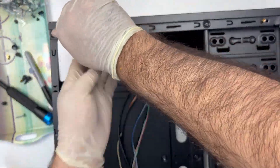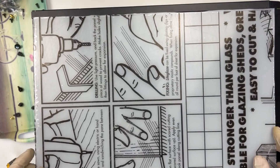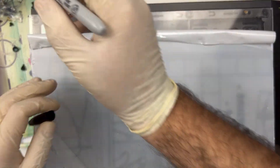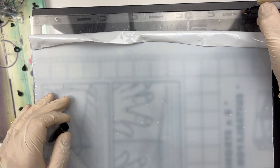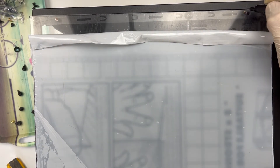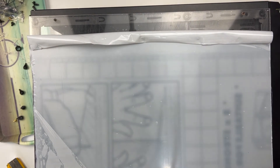Repeat this three more times and you are done. The next step is to carefully position the piece of acrylic until you are happy with it and then proceed to mark all four standoffs. I use a hot soldering iron to punch a hole through the acrylic as I found that using a drill has about a 20% chance of cracking the acrylic and then you need to start all over again. Most likely using a better drill with a better drill bit will alleviate that issue, but I am using the cheapest possible soldering iron here with a sacrificial tip.